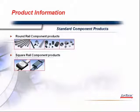These sizes include a miniature size 12, a standard style 15, and a heavy style 25. The size 12 is all stainless with a self-lube reservoir. The 15 and 25 sizes are also available with a self-lube style, but this is an optional adder. Rail lengths range from 1 to 4 meters, and custom cut shorter lengths or longer lengths are easily accommodated with butt joints.